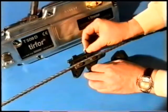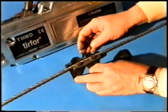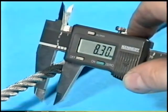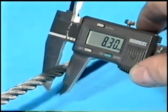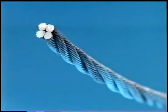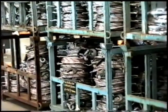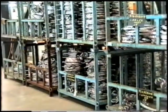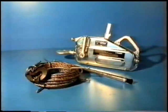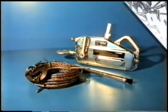The efficiency and safety of the friction grip of the Tirfor jaws around the wire rope depend entirely upon the wire rope being of exactly the right diameter and of a construction designed to withstand the immense gripping power of the jaws. The 4-strand MaxiFlex wire rope is not a standard production rope. It has been developed specially to suit the Tirfor machine. It is manufactured to the extremely fine tolerances demanded by the Tractel Group, necessary for the efficient and reliable operation of the Tirfor mechanism.